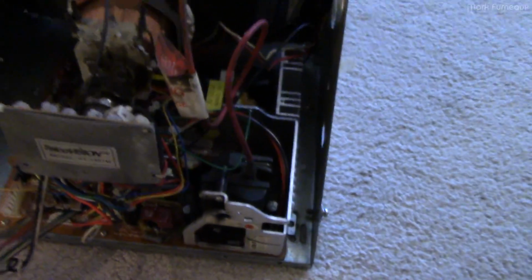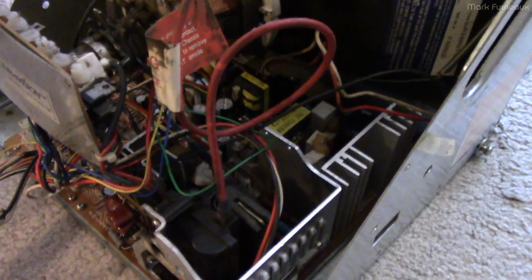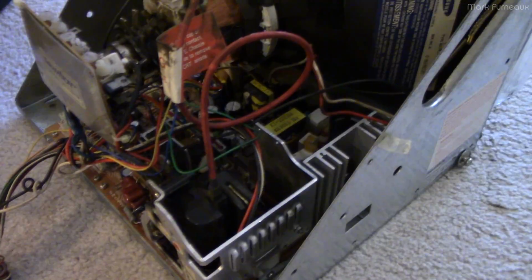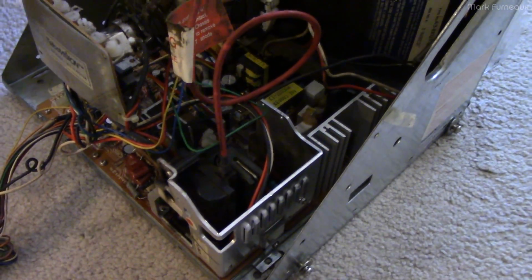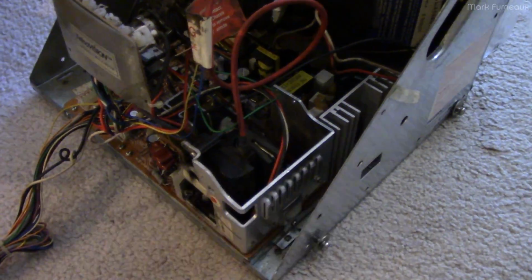So anyway, this thing is a Samsung tube, and you can read that part number if you care. It's disgusting. It's very furry, as the high voltage will of course attract dust. And it's just a bog standard CRT monitor with basically video in, power in, and that's it. So of course I need another flyback transformer for this. And so I looked down and got the part number off of this, and you Google it, and no longer manufactured, nobody sells it anywhere.